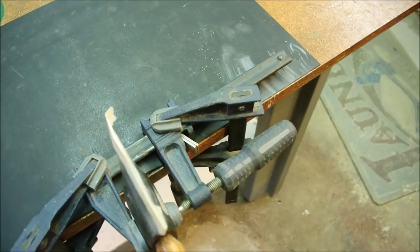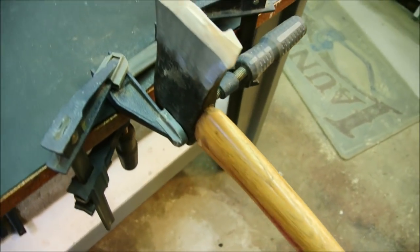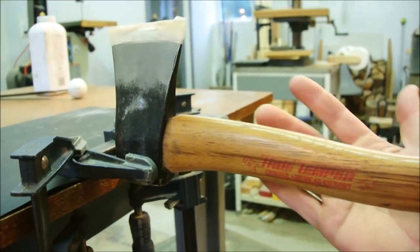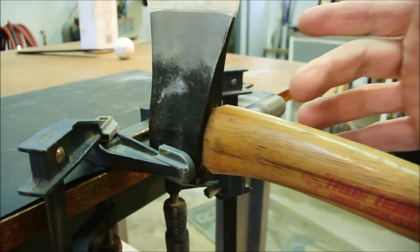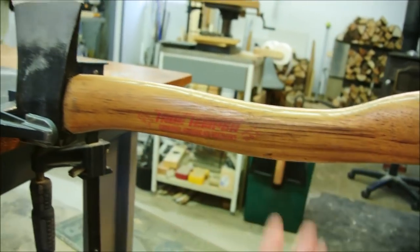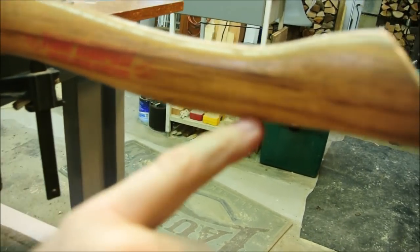No vise, simply because I'm trying to show some alternative methods. This shape is kind of following the archetype for what people expect to see in a hatchet. But I think it's too narrow here, too sharp there, and there's too much meat here. You don't need so much thickness up here — this is not an axe, you don't need a guard. You're not going to miss. It's a hatchet. If you are missing and suffering lots of wear, you need to slow down your hatchet speed. I think this design implies you're only going to hold it one way, and I don't like that — it's somewhat constricting. I'd like the curve to be a little milder, so I'll try to take off some of the high parts as I shape it.